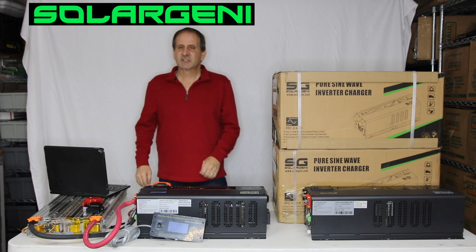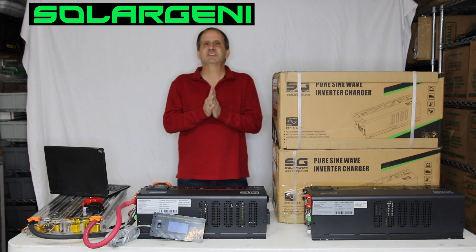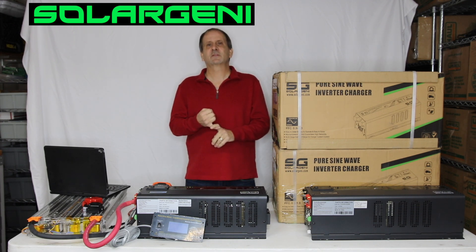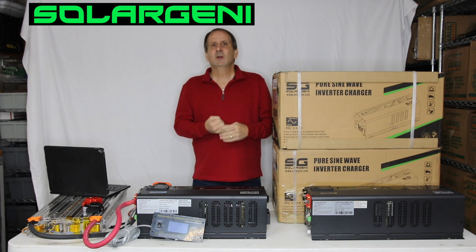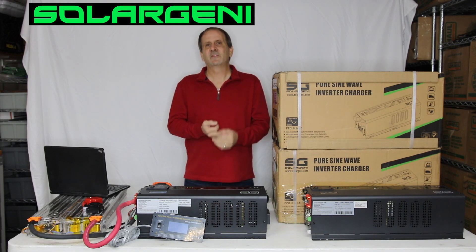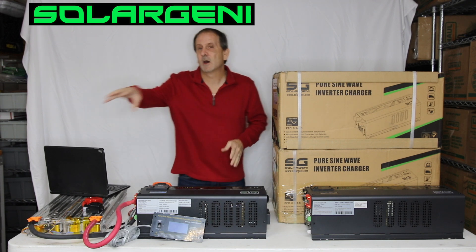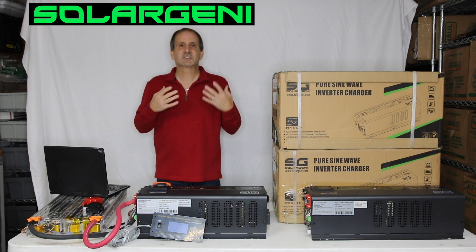Anthony's getting me some BMSs right now. What we've done is we went out and purchased a bulk load of BMSs in every series that you might need them. We start at 3S for Lipo, 4S for Lipo, and 4S for LiFePO4. We go up to 6S for Lipo, then 8S for LiFePO4. We also have 7S for Lipo. We go to 12S for LiFePO4, 13S for Lipo, and 12S for Lipo for all of you Tesla guys that want to run two Tesla modules or more in series and get yourself to 50 volts.